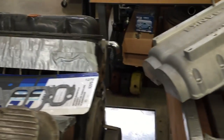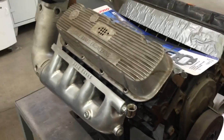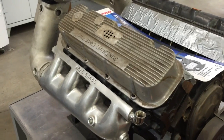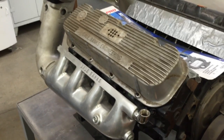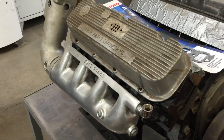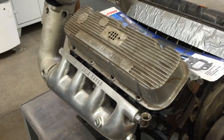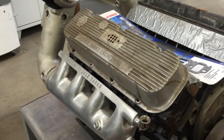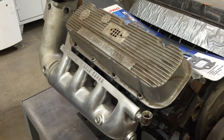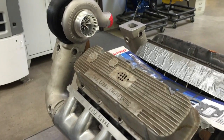The core out of that is going to end up in something I'm playing with here with this big block Chevy. On the big block Chevy you see some of my exhaust manifolds, which have a water-cooled flange and water-cooled port. These I developed for offshore racing about four decades ago, but the design is still current — the port configuration and the airflow capability are still current.